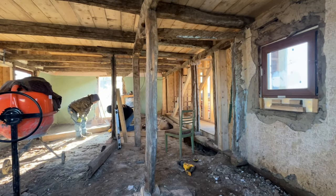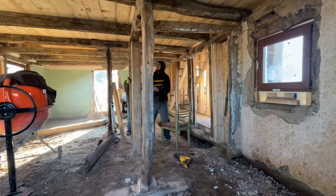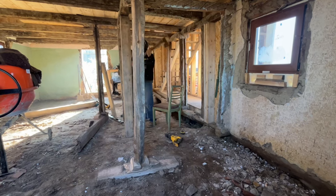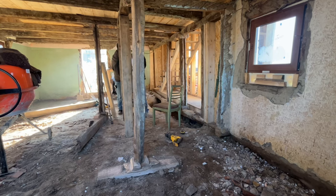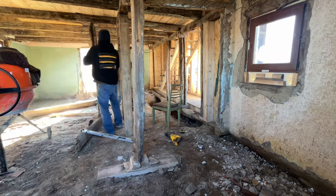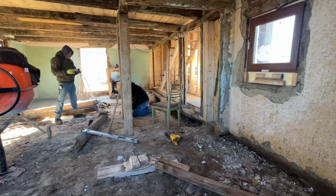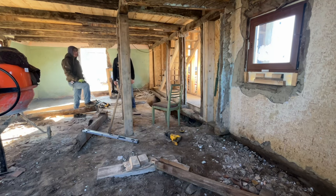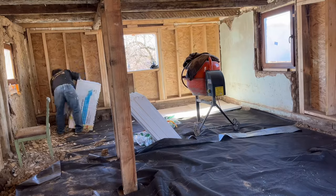After we got done that, we got to work at these other posts. I had to jack up the beam that's running across there at the top — that's going to be across the kitchen. It's kind of low, but I needed that beam for support for my other beams going across because they were cut into a little bit. So I jacked up the roof a bit and put in these temporary posts, then bought posts that are about six inches by six inches, or 15 centimeters by 15 centimeters. We built a concrete footer for them and put them in place with brackets on the bottom. You can't really see the brackets or the footer very well in this video, but I went upstairs and drilled down through the top to get them solid the whole way down through.